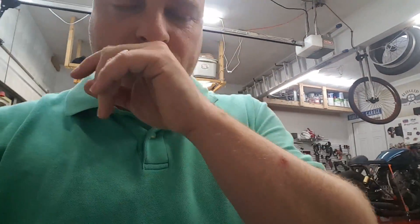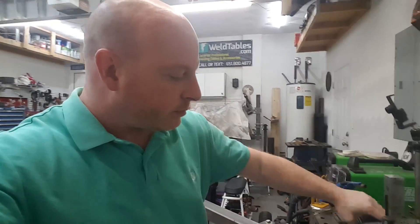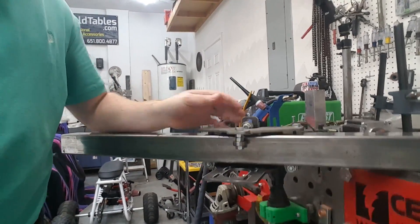I went a little heavy on the wall thickness for the 2x2 box tubing because I don't want any flex or shaking. The carriages come like this — just raw steel, plasma cut, cleaned up with a grinder a little bit. I'll clean these up a bit more, and they come with the bearings and hardware you need to assemble. If you follow the instructions and weld everything together, this is what you get — that's our carriage.